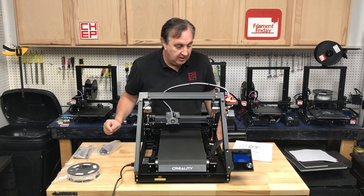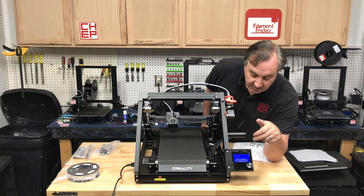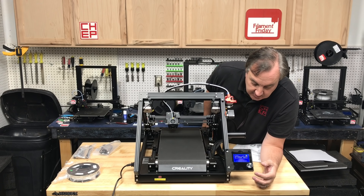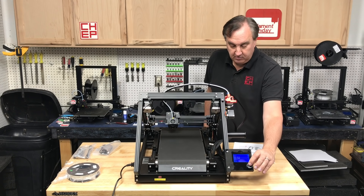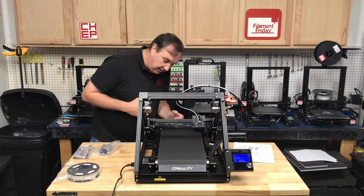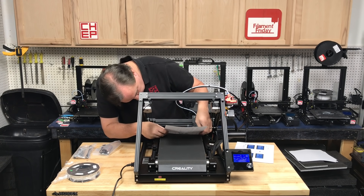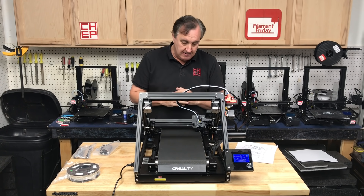Let's turn it on — it's got a really cool screen that comes up with the 3D Print Mill logo, scrolls across, then shows Marlin 2.0.6. Once that's done we go to the motion menu and auto home. It's moving across and there's a stop switch on the arm. The heater block is not hitting, so I can slide a paper underneath the nozzle. It's pretty close to the bed, so I may have to adjust, but I'm going to print with it like this and go from there.